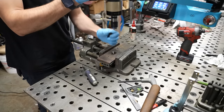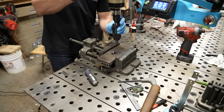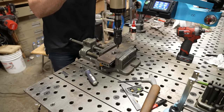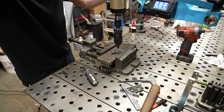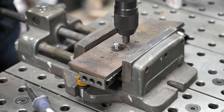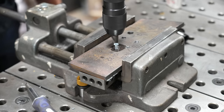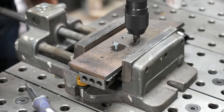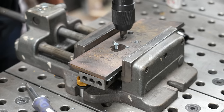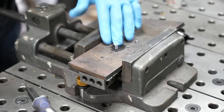With that done, if I want to switch over to the quarter-20, those holes actually look like they could use a little deburr. I switch over to the drill with the countersink and I can do a quick deburr. I'll set my speed up to the highest setting, which is 300 on this. I'll deburr all the holes while I'm at it.